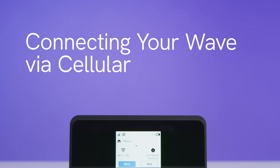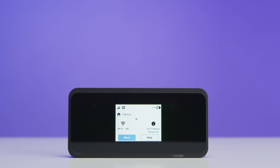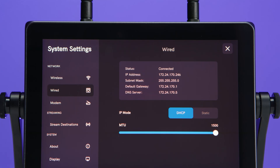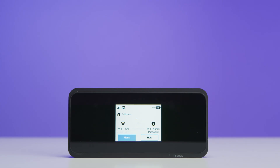The third way you can connect your WAVE to the internet is with a cellular signal via cellular modems and hotspots that allow USB tethering. First, we'll connect our compatible modem to either of the USB ports located on the top and bottom of our device. Under our WAVE system settings in the network section, we'll tap the Modem tab. We can see the green circle next to Modem 1, indicating that our cellular modem is connected properly. By default, we can only use one modem at a time. To bond two modem connections together to increase our broadcast bandwidth, we can employ the use of a ShareLink account.